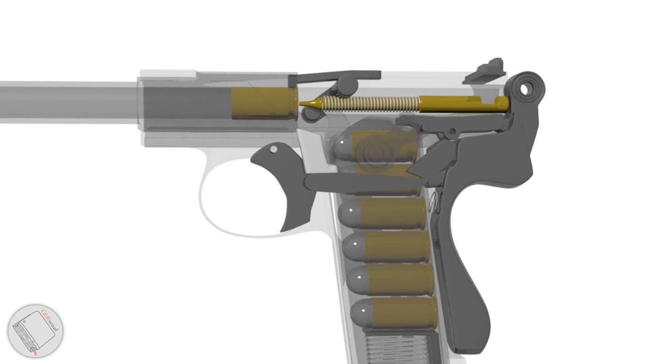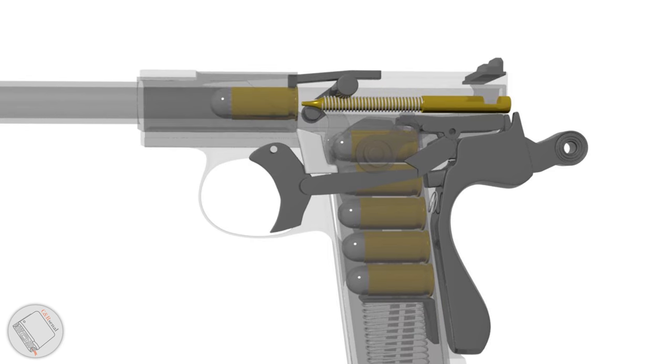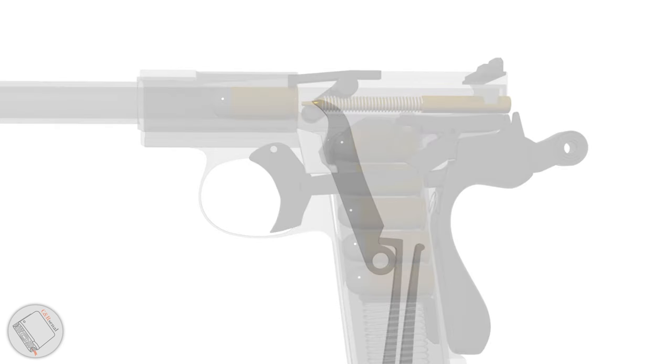The pin is held slightly rearward by this long coil spring. The slide is constantly pressed forward by the recoil lever, which, in turn, is powered by this V-spring set in the right side of the grip frame.